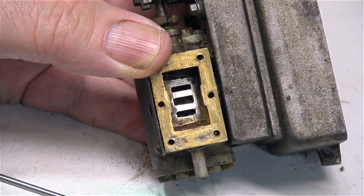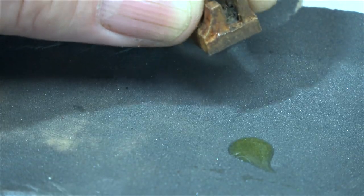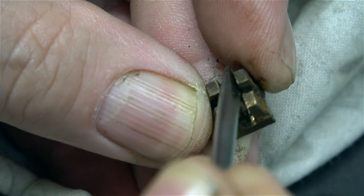I've been tidying up the port face using a piece of wet-to-dry sandpaper and a piece of mahogany. Now it's time to clean up the slide valve using a spot of oil on some 400 grit wet-to-dry sandpaper, and in no time at all that's fine.